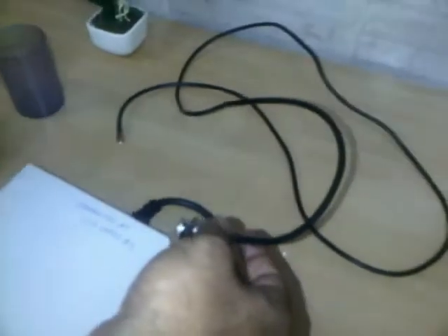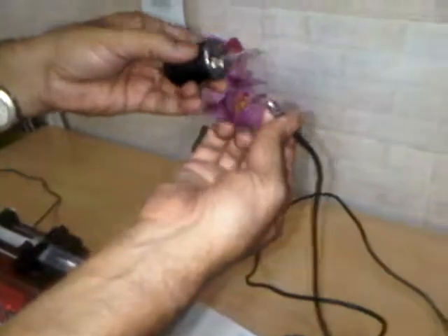This is a BNC cable which delivers electrical power from the generator to the nozzle. I am connecting the BNC cable on the back — just clip it in and turn it slightly. On the nozzle, it is a threaded pin — put the pin in and tighten the thread.